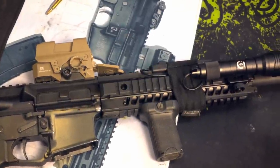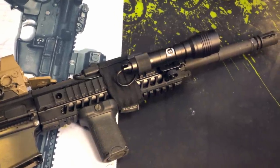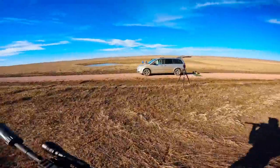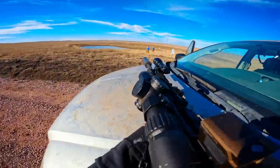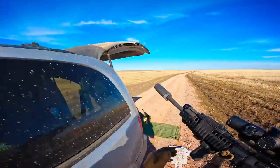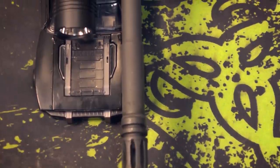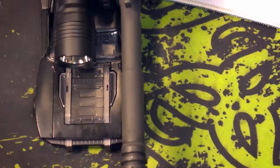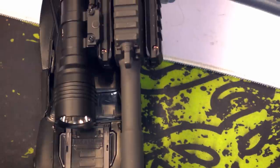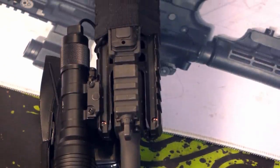From the bulk of this video, I'm going to be going over just what the thing is. Starting off with the basics, this is a 16-inch 5.56 chambered barrel. It is a cold hammer forged nitride barrel, so it is not chrome-lined. QPQ nitride is a very good coating — there are pros and cons versus chrome lining. The nitride barrel in here is a perfectly fine, very high quality cold hammer forged barrel, 1-in-7 twist, 5.56 NATO chambering. It came stock with an A2 flash hider. The one minor gripe with the barrel is the profile — it is a product of its time, though it did perform very well on accuracy.